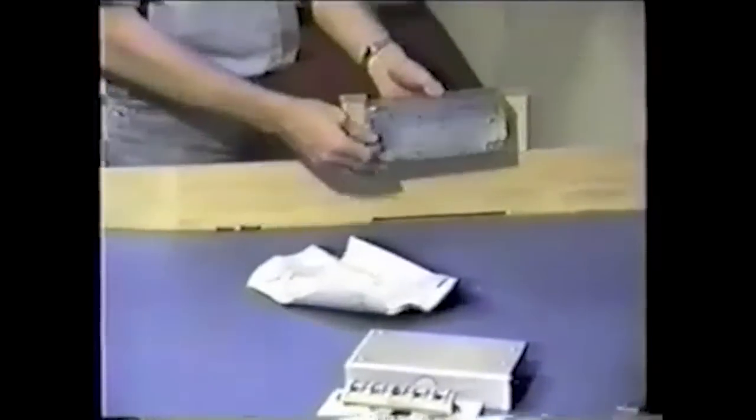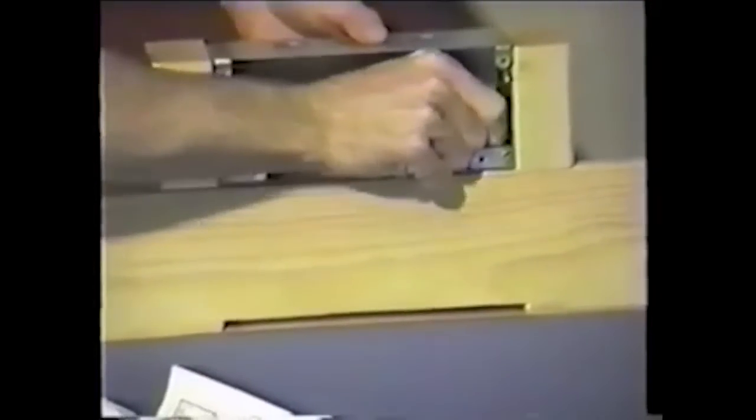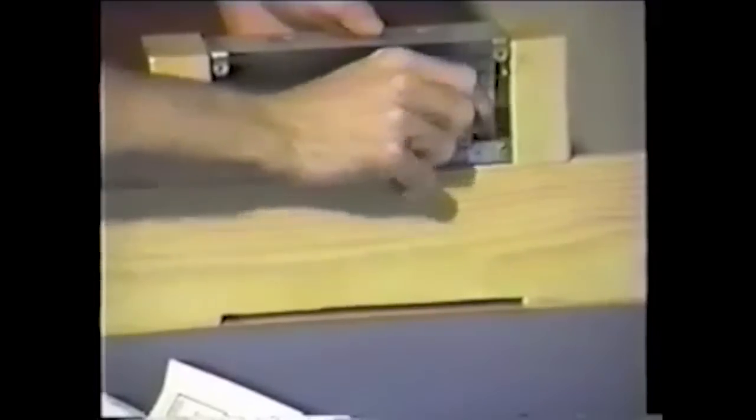Installation of the undercarpet cabling system begins with the transition from round wire to flat wire. First, select and install a transition box. A flush mount wall box is shown here. Instruction sheets are supplied with all components to assist the installer with the procedures required for correct installation.